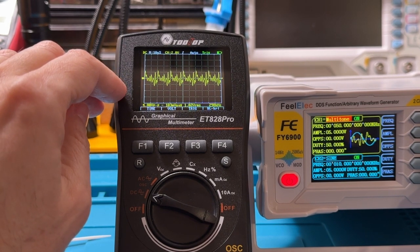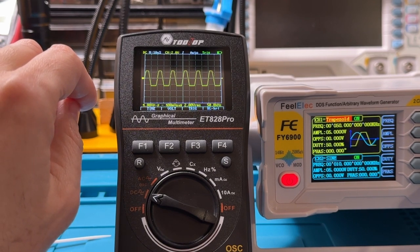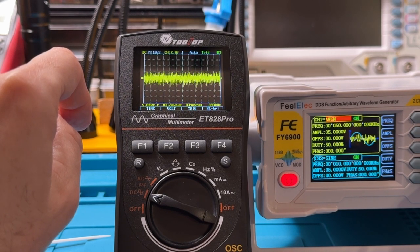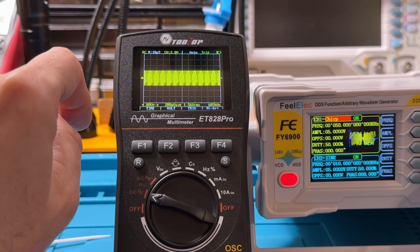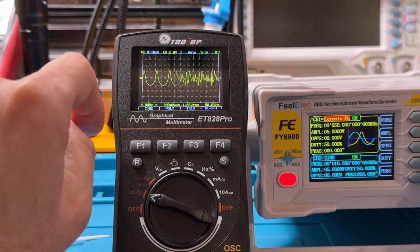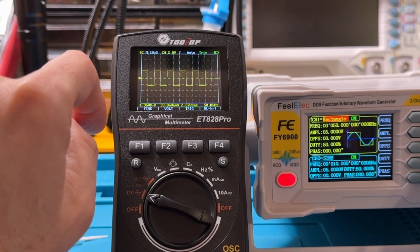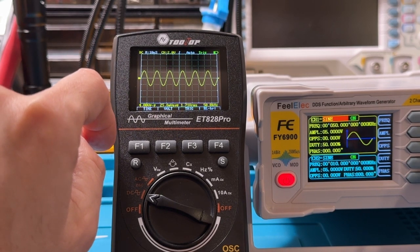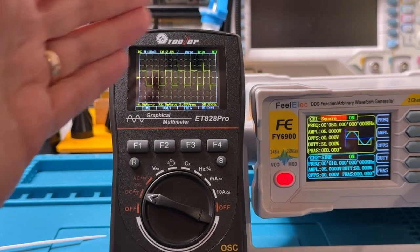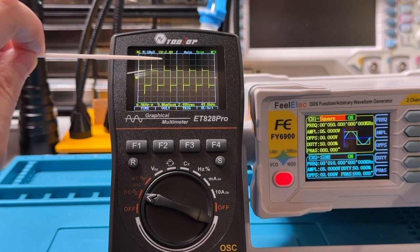This is a multitone, random noise, ECG, trapezoid, what's called a sync pulse, an impulse, and then a variety of other signals. So the function generator can generate all kinds of signals here. We can see, just go back to the sine wave. It'll take a minute. So it works great for a sine wave. With the square waves and a lot of other signals that have discontinuities in their form, you tend to see this kind of pulsing at some of the edges, which is a sampling issue.